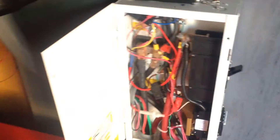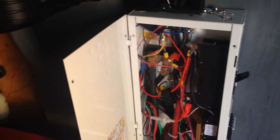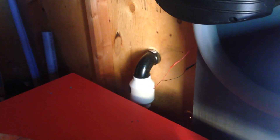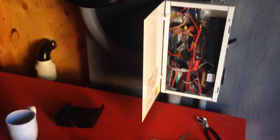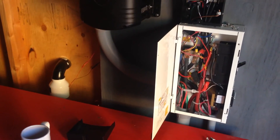This is really here for anyone looking to solve the 24 volt problem when you have a 24 volt fan, load, or higher voltage load and you're connecting it to your Outback or other charge controllers or inverters. Because these auxiliary relays, it doesn't matter if you have a 48 volt or 24 volt battery bank — if you're going directly to these relays, they're only going to kick out 12 volts. So that's your solution. Hope that helps — take care and happy Thanksgiving to everyone.